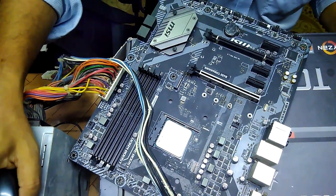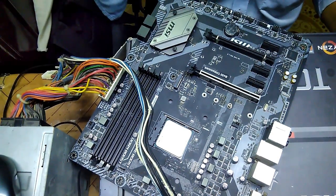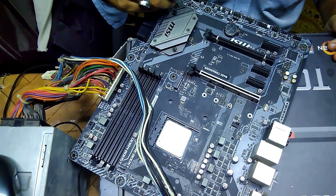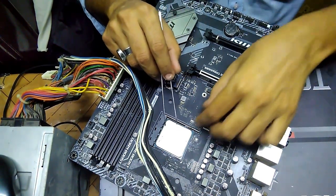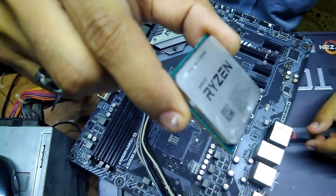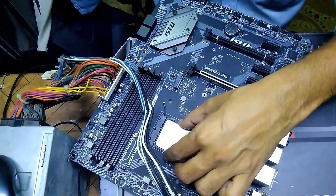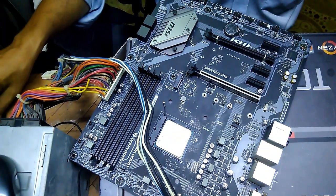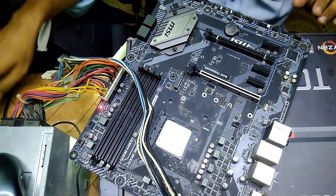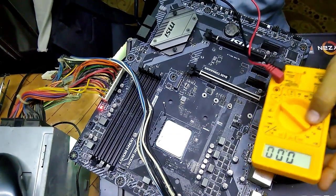So today we are going to diagnose it. I have the motherboard diagrams and I looked at them and found out that there are specific pathways to the processor. If you put in an unsupported processor, it will not turn on. But this processor is a Ryzen 3500X - let me show you - it is completely supported in this motherboard, but still it is not turning on. As per the diagram I have been tracing, when I turn it on we have all the voltages present - with the processor we are getting all the voltages.